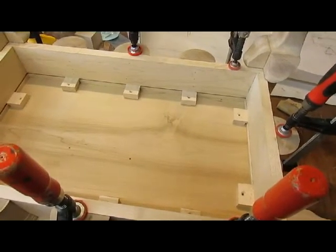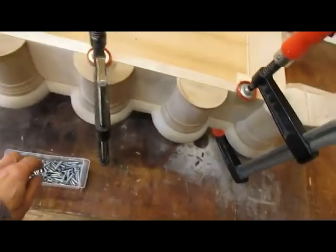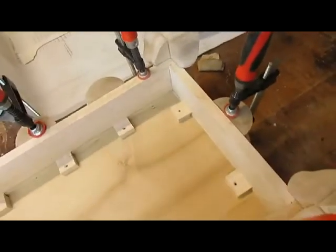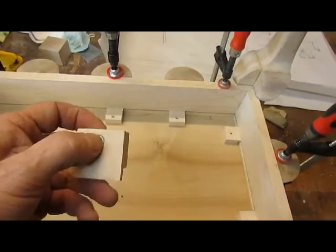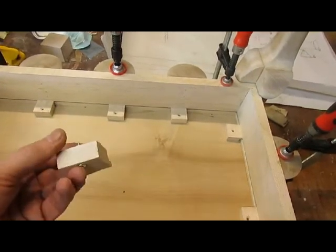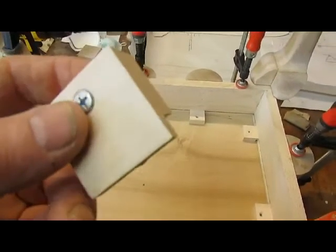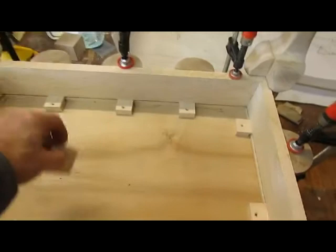And then I took the tabletop buttons that I had made earlier. They're 5/8 of an inch thick. And I've got some 1-inch number 8 screws here that protrude. A little practice one here, and they're pre-drilled all the same way, and I did them on the drill press, and that screw comes through the bottom 3/8 of an inch. So the top is 1/2 inch thick, so I'm leaving myself a 1/8 of an inch there, so I should get pretty good traction.